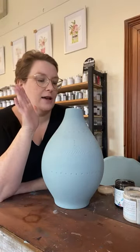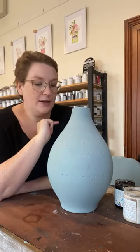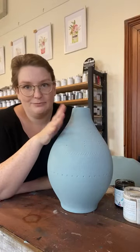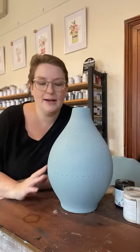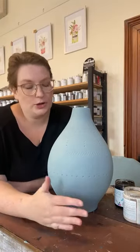So I definitely cleaned it, I always clean. Hot soapy water to clean. I then scruff sanded. I always scruff sand vases. Just helps your paint stick, gives something else for the paint to grab onto. Particularly something like this that is quite smooth. Even though we've got the detail here, it was still a very smooth vase. So I've given it a scruff sand, 80 grit. It's not gonna do as much as it would on a piece of timber furniture, but it's still going to scruff it up a little bit and it doesn't hurt.